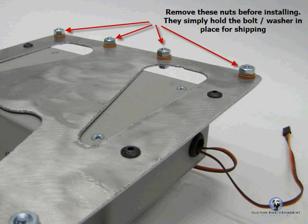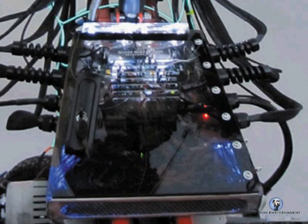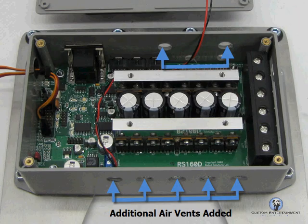In general we take a lot of care with our robotic enclosures. This is the main one we designed from scratch for AWSM. Especially important is keeping things cool, and that's why we do full CFD — computational fluid dynamics — analysis like this here. We didn't do that on their product but it looked pretty apparent that we needed to add some vents to let more air flow through there. There's going to be potentially a lot of amperage going through those circuits and we'd like to dissipate that out to the environment. There was a cooling fan on it already — just wanted to help it out.